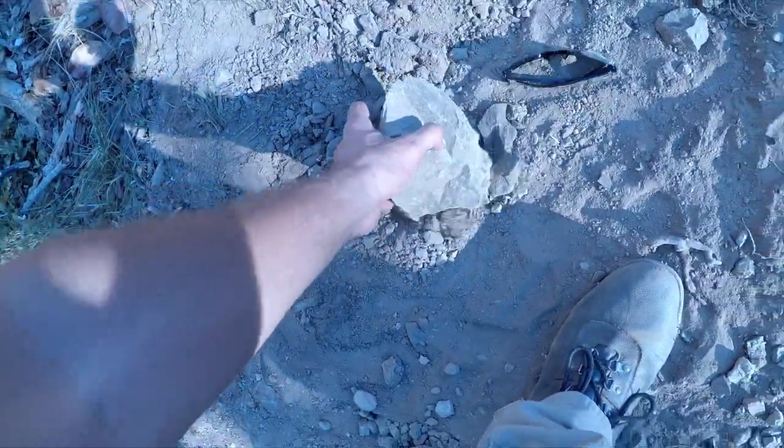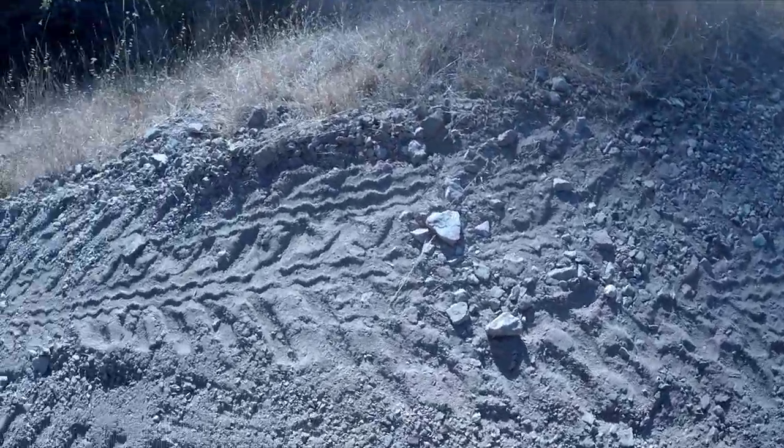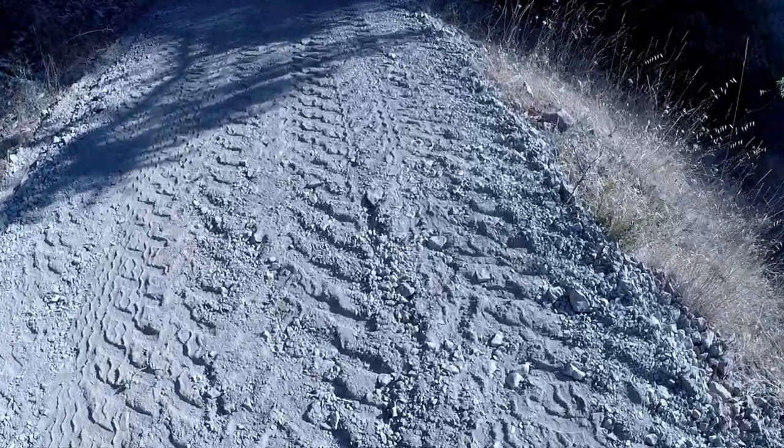Right now it's just too dusty and there's no moisture, so I'm not going to waste too much time trying to get compaction. Problem with wheel loaders, it's so hard to grade when you got these big rocks. Put a big line down the middle of your cut. Let's see. It's a little bit of a hump right here because it's an old water bar. That will get some compaction and then I'll dump some more rock on here. We'll be done with this project.